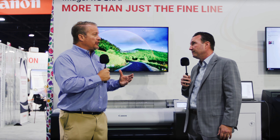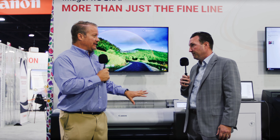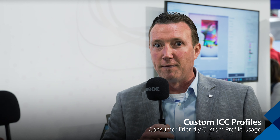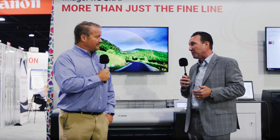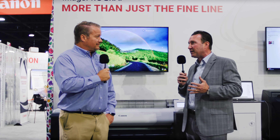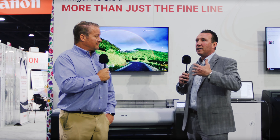One of the things we changed: we replaced the magenta ink, so the reds and magenta area of the gamut have been expanded dramatically. We've also created custom ICC profiles for every media type we sell, making it much easier for customers to create their own custom ICC profiles. It's not just the red and magenta areas — because of the new ICC profiles, the blues, greens, yellows — the entire gamut of this machine now fully encompasses that of the prior machine.